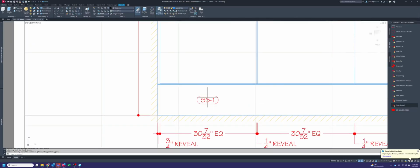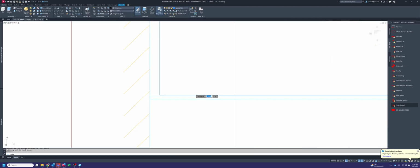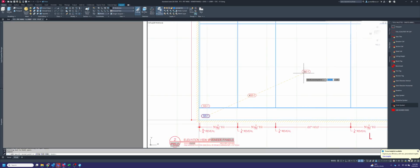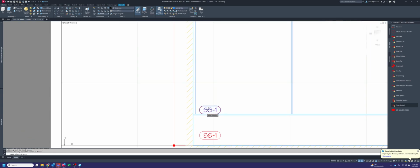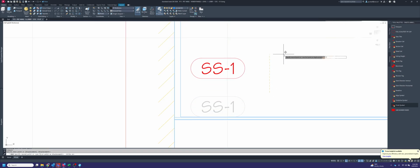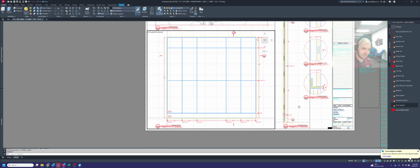And then when you put these on your drawing, this might be a little bit over the top, but it is important to try to bring these in. I usually go from the corner out 2 inches, over 2 inches, kind of like that. I've also seen people center these on their print, and that's perfectly fine as well. You just want to make sure that they're not plastered all over the place like that. You really don't want that because it's not going to look good at all. What you want to do is make sure that you're being consistent with where you're putting those material calls. So if you're putting them in the corner or moving them 2 inches up and 2 inches to the right, that's fine. Just make sure that you're maintaining that same method as you go through and put those material calls on the drawing, just for consistency's sake.